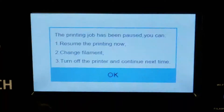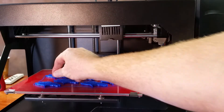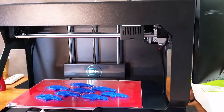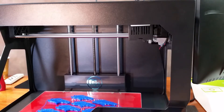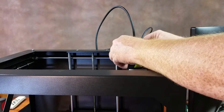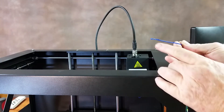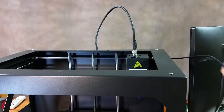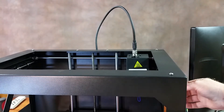As you can see, it is going to a home position, which is a huge improvement over what I've had to deal with in the past. I want to keep everything hot but switch out the filament, so: change filament, unload. Let me raise this up higher so you can see. I'll go ahead and extrude a little bit of filament and then pull it out by hand — that way I can see the shape of the hot end on the inside and know it's cleaned out. I'll go ahead and cut that off so I can use it at a later time.